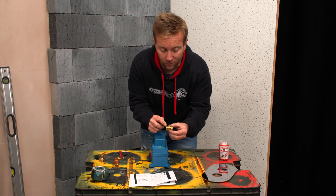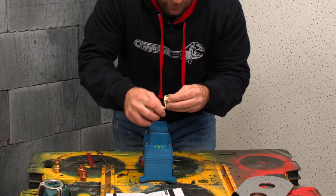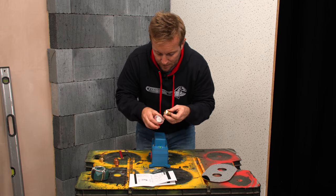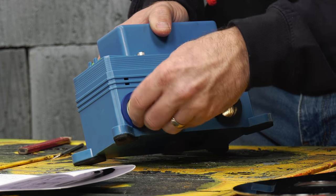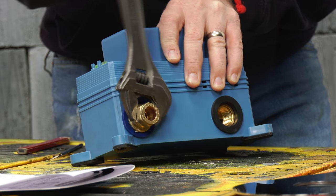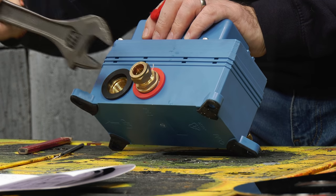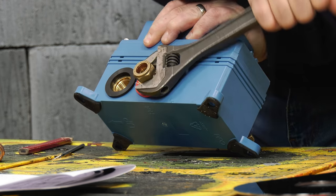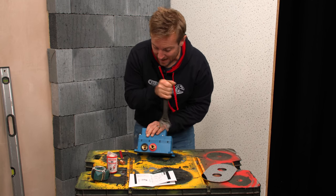So the first thing I'm going to do is use a three-quarter to 15mm compression fitting. Very simple. I use Loctite 55 thread — you'll be able to find this in our Amazon store as well. We just crisscross that over a few times just like so, and then we wind that in to the valve body itself and tighten that up. We'll do the same on the hot side. One thing I really love about this is the fact that everything is protected when it comes to the top gubbins, which we'll be coming to later. Having that cover on there to protect all the valve workings gives you real good peace of mind as you're doing the job.